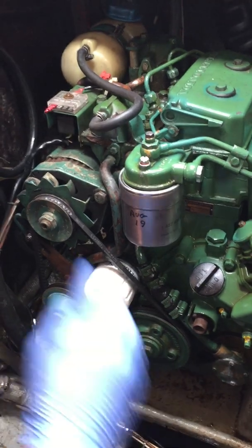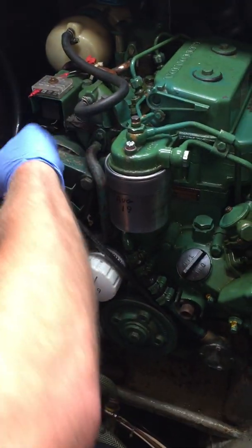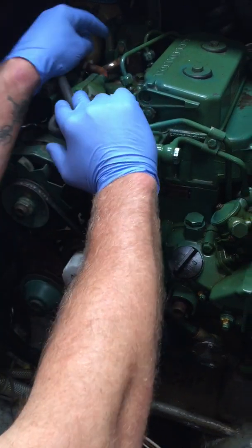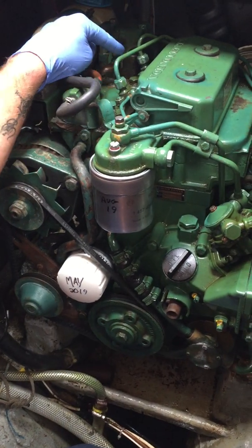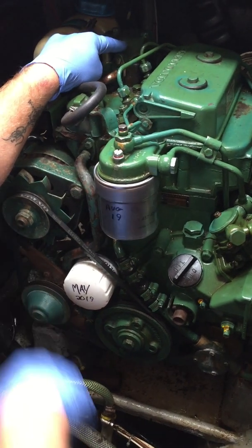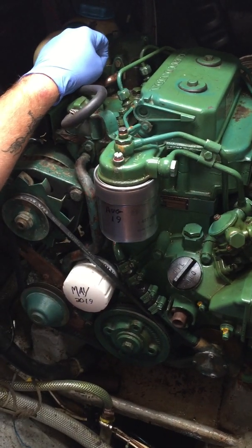Where's the salt going? So salt water goes through it - the very last place the water goes is out your exhaust. This little feed pipe here is raw water going into the mixture elbow, which is why you get water out the back of your exhaust. So that's the yucky water going out the back.